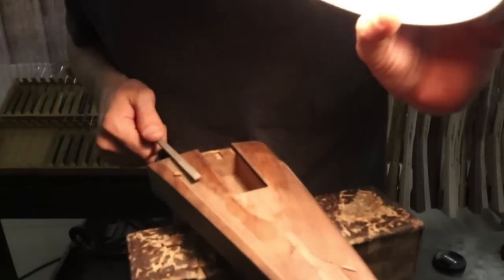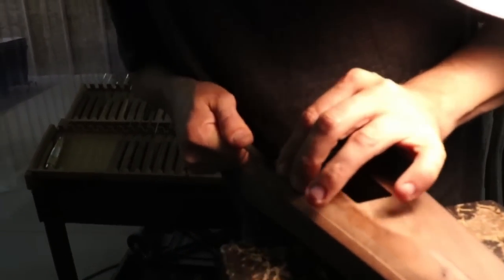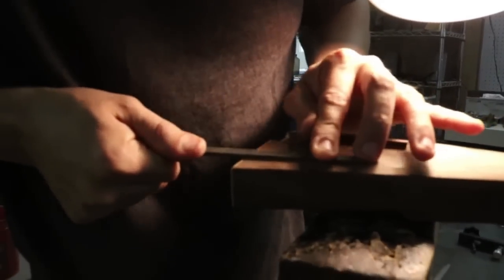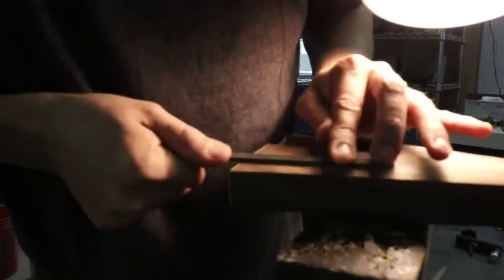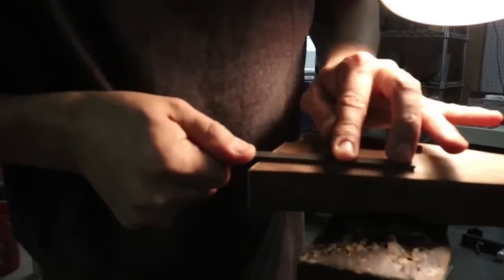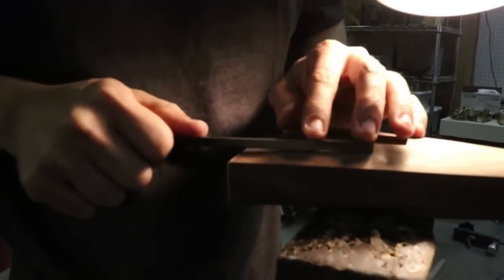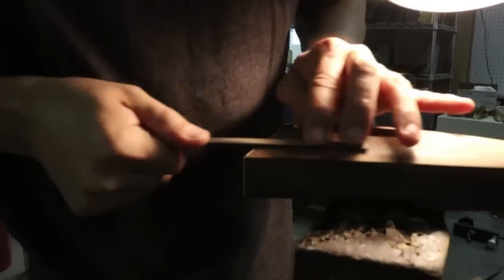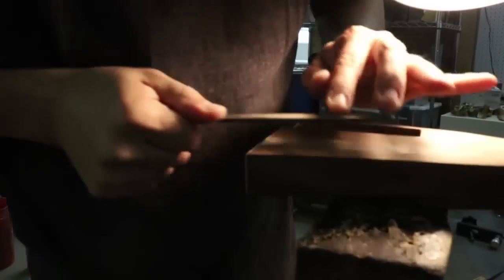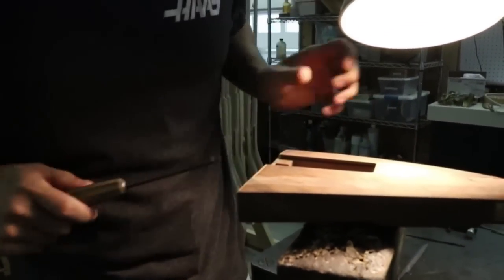Let me get this file again and come in here to define this notch a little more, lay it a little flatter. Now, this gun is carved pretty heavily — it's just a style I want to use on this gun. By heavily, I mean there's a lot of carving, quite a bit of carving, and it's fairly deep and bold. That should be enough of a start. Maybe a little deeper here — keep running along again.